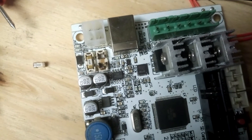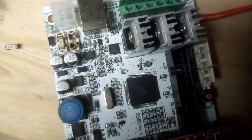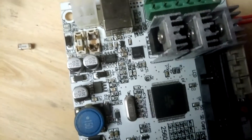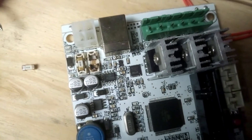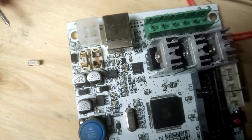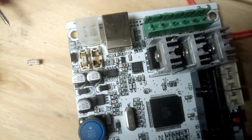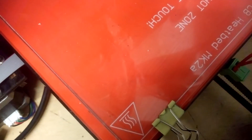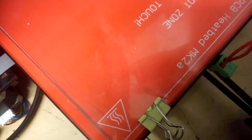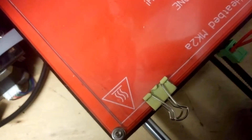I don't know what caused that. I'm not going to repair the board, and I'm not even going to replace the board - certainly not with another G-Tech. I've been on the internet and for about 23 quid I've ordered myself a complete RAMPS kit with the LCD, stepper drivers, and basically everything I need. I'm also replacing the standard heated bed - I've ordered an aluminium Mark 3 heated bed, along with an induction probe.